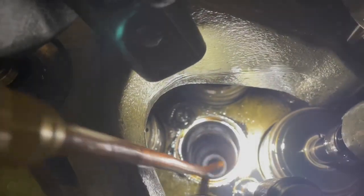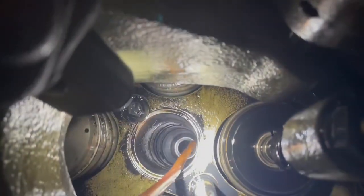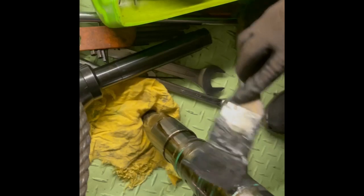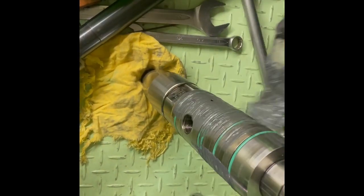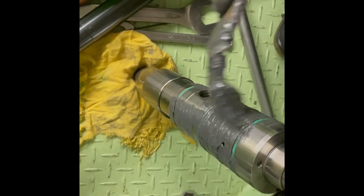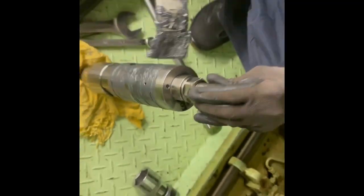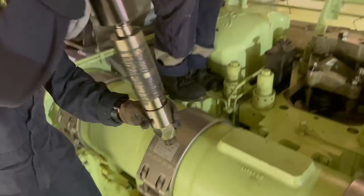The pocket and the seat itself is nice and clean now, so we do a final air blow. In preparation to have the injector back on, we will check the o-rings, replace them if needed, and before installing, we will lubricate them with Molykote.